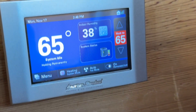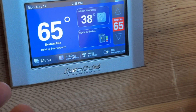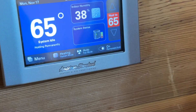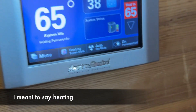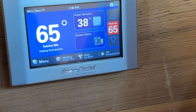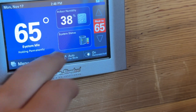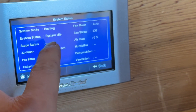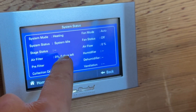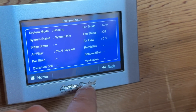They said it froze up, but I just talked to the homeowner and basically it was frosted up — that's normal because it wasn't cooling and it's been pretty cold. We've been getting down to about 30 degrees in the evening, so I'd expect to see a little frost on there. Filters have just been changed per the homeowner. We're on idle — everything looks okay.